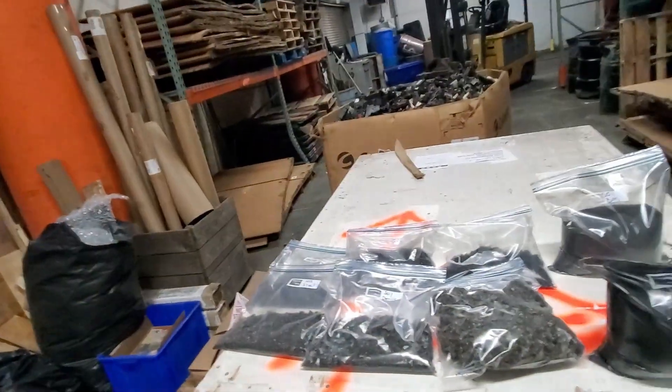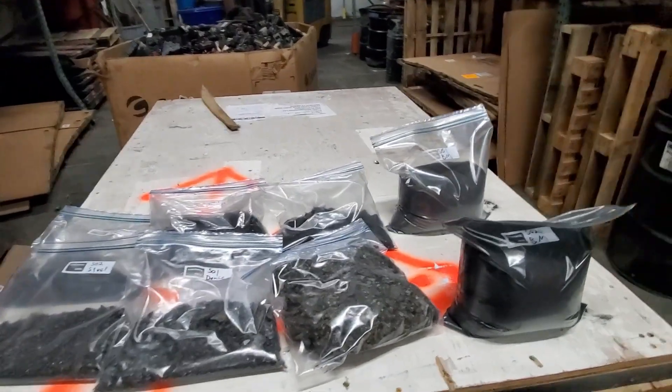Okay, so just a recap of what we did. We took the batteries, went up the conveyor. I probably would use a different style cleat if we were to build a system specifically for this, but we went with regular AA, AAA, D, and C batteries up the conveyor, and then we also ran some lantern batteries. We went up the conveyor into the vertical mill, from the vertical mill to the cyclone blower cyclone, and then we took all of those fractions and brought it over to the screener.